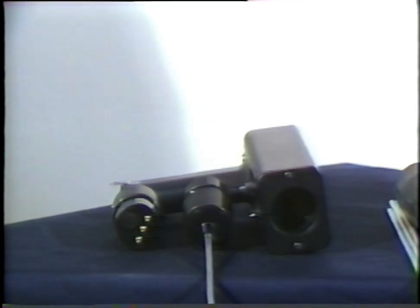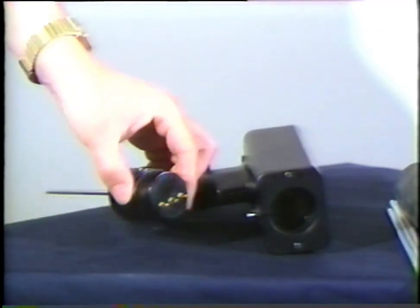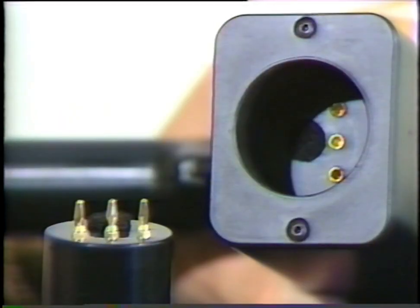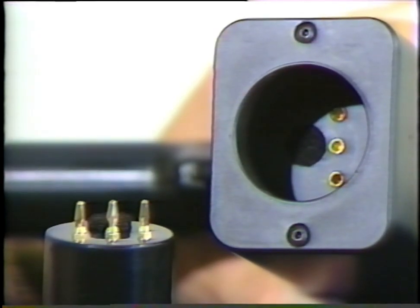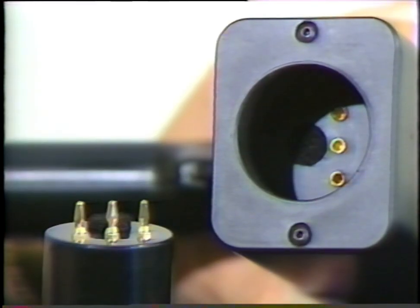Now let's examine the use and function of the 2 attachment modules, the trisonic scanning module and the contact module. This trisonic scanning module is utilized to receive airborne ultrasound, such as the ultrasounds emitted by pressure leaks and vacuum leaks. To use the scanning module, align the prongs with the 3 corresponding holes in the front end of the metered pistol housing and plug in.